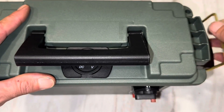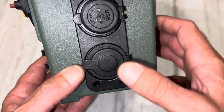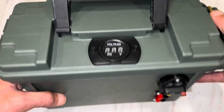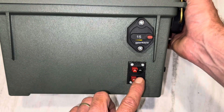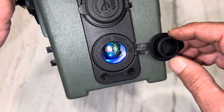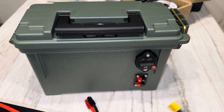Close the lid — the wires tuck down nicely. Lid closes and snaps on. There's our voltage meter, our main disconnect switch, the Anderson connectors, the USB in the front, and the cigarette 12 volt socket. To use it, hit the switch and there's your voltage display — 13.2 volts because I need to charge the battery. Everything's live now — the Andersons are live so you can take power out from there, and there's a nice little light in the socket.